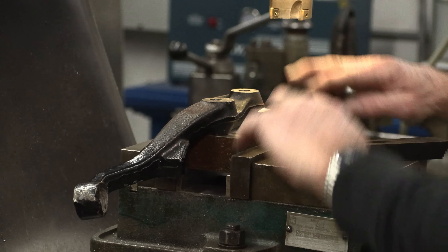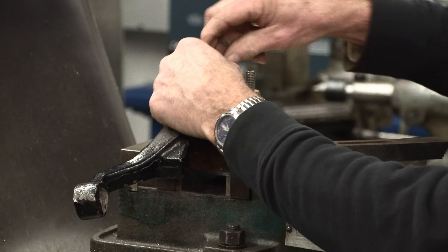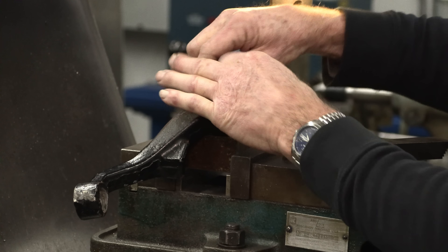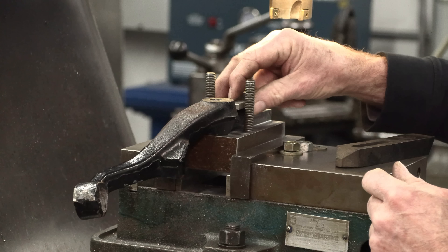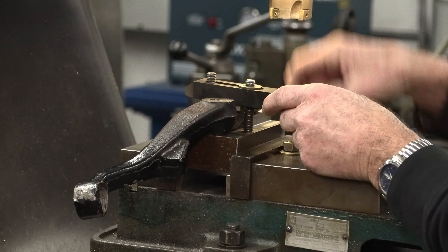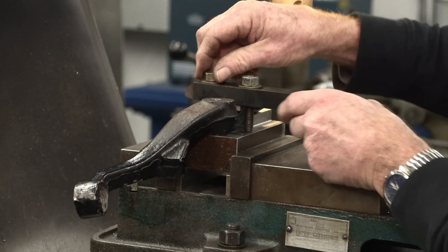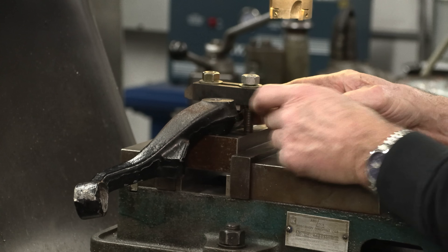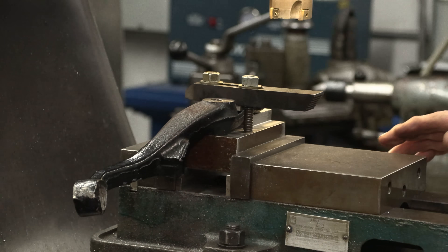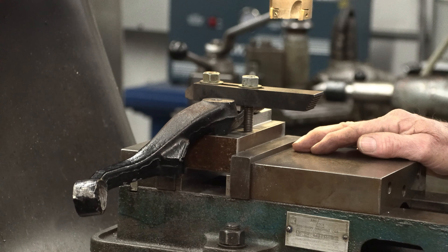I don't have toe clamp capabilities to come in from the side, so I decided to put in two stud holes on each side. I drilled and tapped two 7/16 holes. Drop an aluminum pad — something softer than the block — coming in and catching a little bit more. Then we're just going to run two flat washers right there. We probably ran that stud in just a little bit too much there. Then we can tighten it down and come in on each side of the clamp with this cutter and take that eighth inch off.